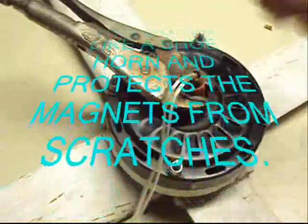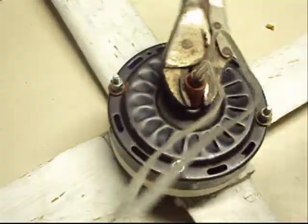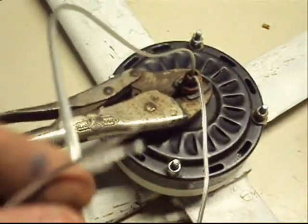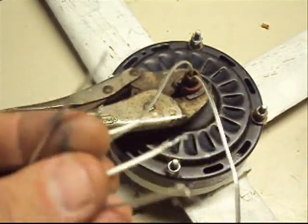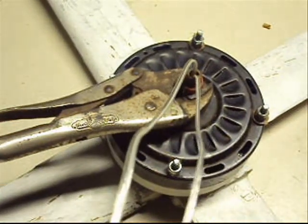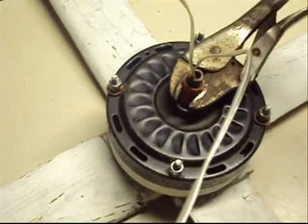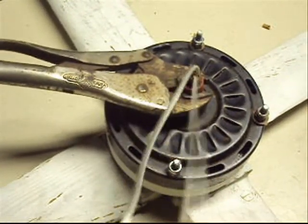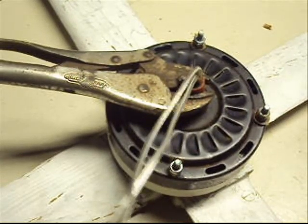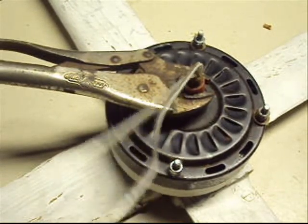All righty here. Notice I got the vice grips on here and we've got it all put together. Now let's spin this. You're going to notice it kind of spins pretty free — not a problem. That's because these four wires that I just soldered on are not connected to each other. Let's twist two of them together. Just a little bit. Give it a spin. Doesn't go very far. Making electricity. And as all the mechanical energy is going into the coils and being shorted out at this end, all the work is being used up and that slows it down.